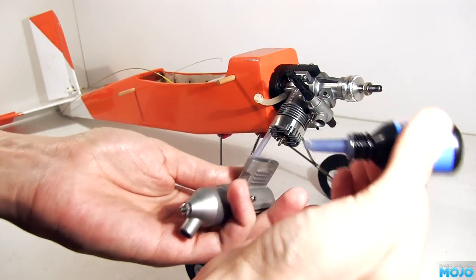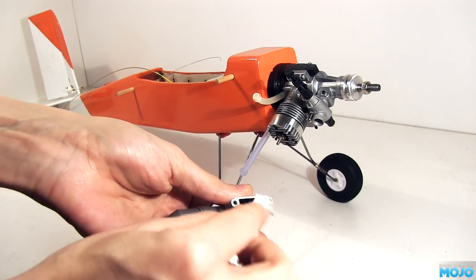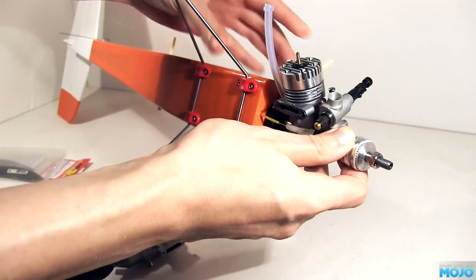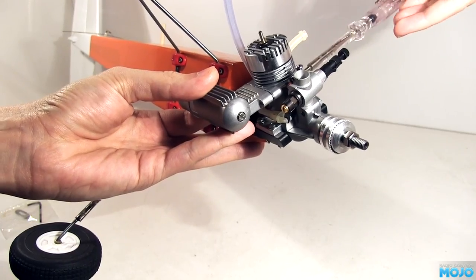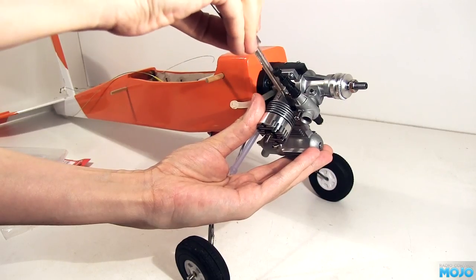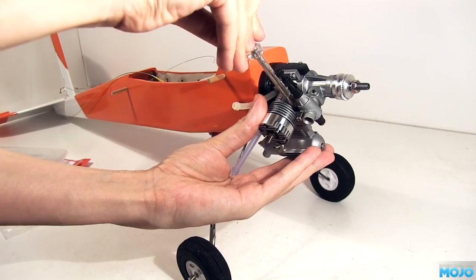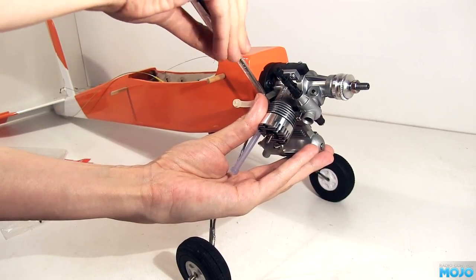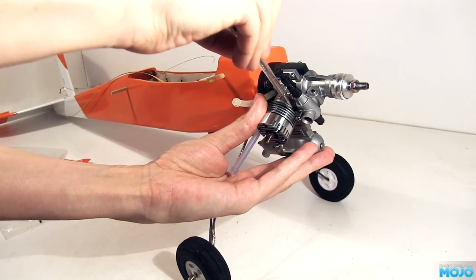Now, I say only use Loctite if the holes are open-ended, as with blind holes, like on the old MDS engines, the Loctite forms a seal around the screw while you're screwing it in, the screw compresses the trapped air, and will more often than not blow a small hole in the aluminium. Worst case, the screw won't hold the pipe on anymore, so be careful.